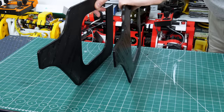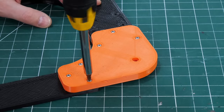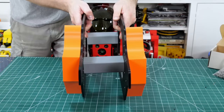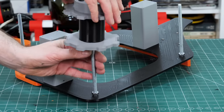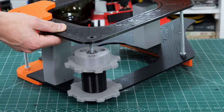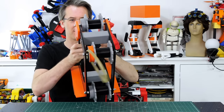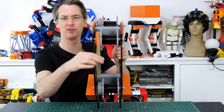There are a pair of those on each end which go opposite each other. I made these separate orange tabs that screw onto the missing corner of those parts — that means I can easily replace that part and move the holes around for the sprockets to adjust the track tension without reprinting the whole thing. There are some grey spacer blocks in the middle and also some extra orange blocks on the outside. I'm putting studding right through here to run my sprockets on, and that gets bolted to each side so the whole thing should be super rigid with those spacer blocks screwed on and the studding bolted too.